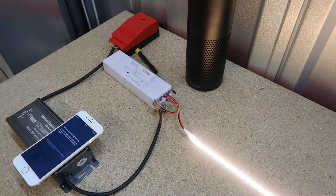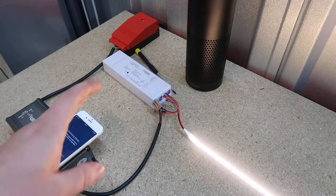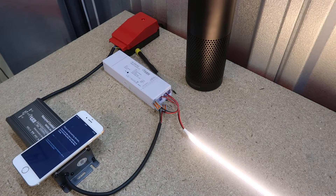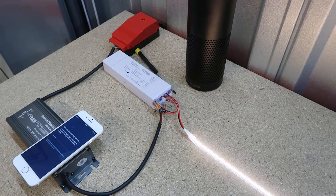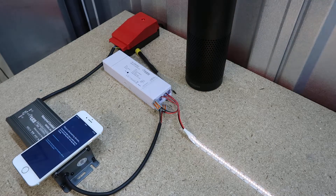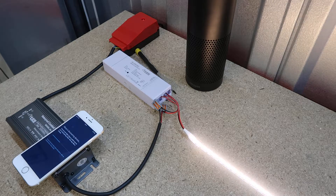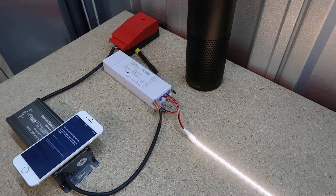While it's discovering, the LEDs will flash solid on and off a few times — that means it's connecting. The app will take quite a while to catch up. If you had more than one controller in the mix and followed the same steps, Alexa would discover both controllers if they've been powered on within the last five minutes. It should call this one First Light, and the other one Second Light, Third Light, and so on.